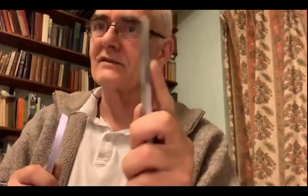Now, if you want to try this, you can use a diamond, as I said. I have in the past used the back of another tool. As long as the metal, the burnishing part, needs to be harder metal than the cutting part. Just for interest, I tried using a glass bottle. That works. You wouldn't want to stay using that because you don't want bits of glass in the workshop because they get broken. But to try the action, if you haven't got anything else, it does work. You could probably use stone, a smooth bit of flint or something.